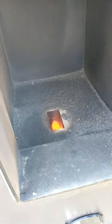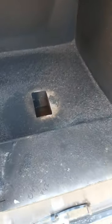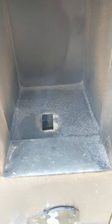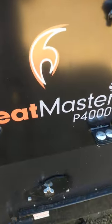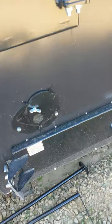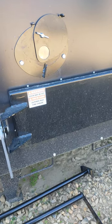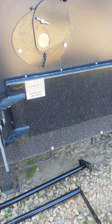You can hear the suction of the fan. Under a full burn, that flame would be shooting up like a torch all the way to the top of the firebox — a white hot flame coming up through there once it's up and running. Underneath, there's an ash clean-out. Probably every month or two, you'll be taking a gallon or two of ash out the bottom.